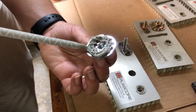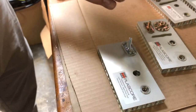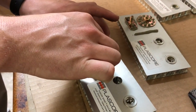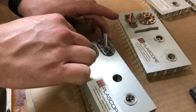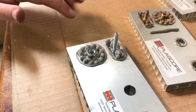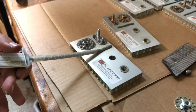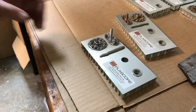This adhesive actually has glass beads mixed into the product — this protects against human error. You can't over-clamp this because there are beads mixed in, so that's always going to create that perfect bond line if you press this down. And then I'm just going to do one more bead of adhesive here. There we go.